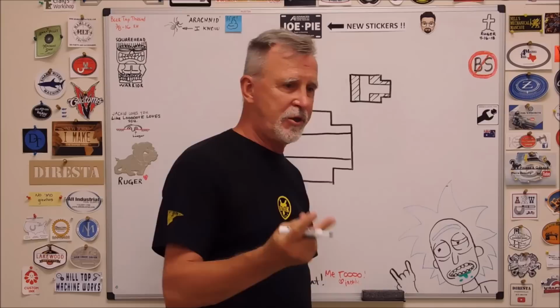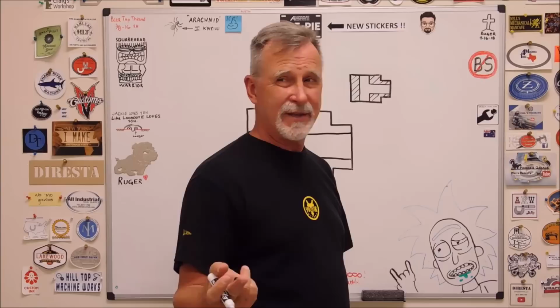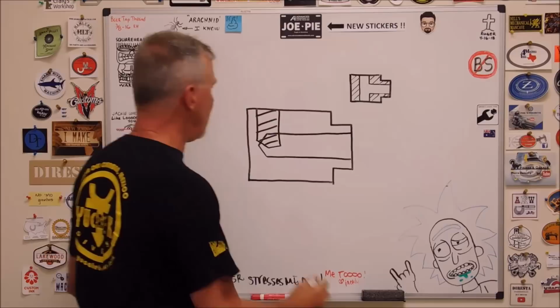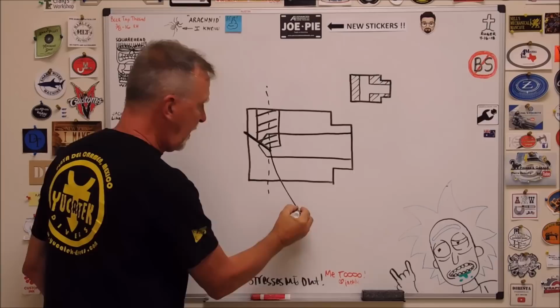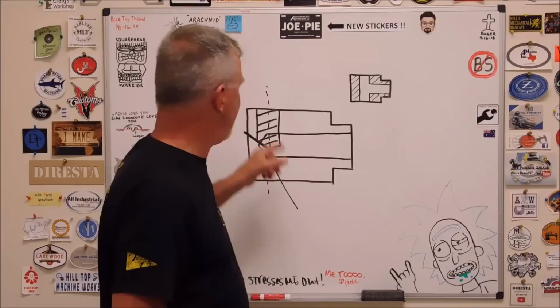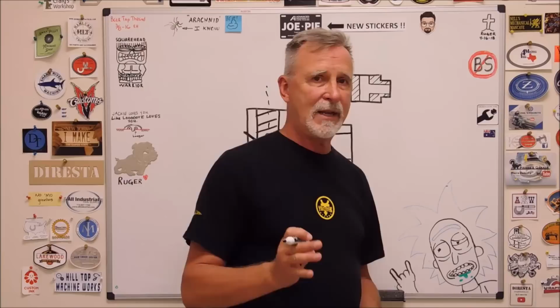Either it's going to wipe the edge off the tool, depending on the steel, of course, or it's going to deflect. And deflection is probably the number one thing you can expect, especially with a very small tool. So instead of this coming straight through the part and leaving the other side of the part where you think it's going to, it could possibly be influenced by the load on this side of the drill and do this and come out. So when you do a part like this, drill this hole first, and when this one breaks through, it will break through a lot cleaner and equally.